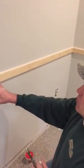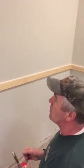Come back in a couple hours. You want to give it a couple hours to skim over and dry. That way, if there's any oil residue, it skims over and it won't soak through the paint when using latex paints.